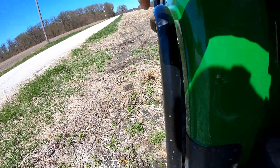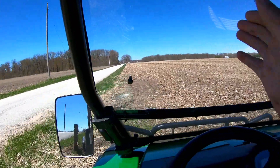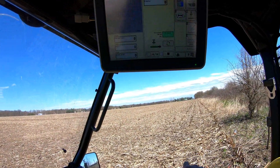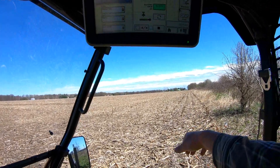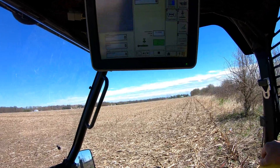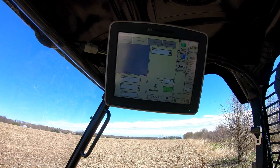Obviously you would have to drive right on the very edge in order to get the precise RTK boundary if you want that. I'm going to set an offset of five feet, that way I have a two-and-a-half-foot bubble so I don't have to drive directly on the very edge of the field to get the line. It's showing that the line's going to be created based on the outside width of the Gator. I'll go ahead and switch that to the driver's side, because that's where I've been doing all mine. Once you have all that information in, you can go ahead and press the record button and take off and do the field.